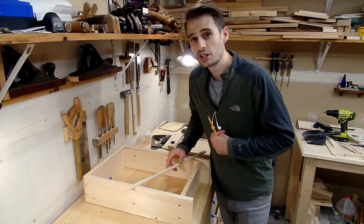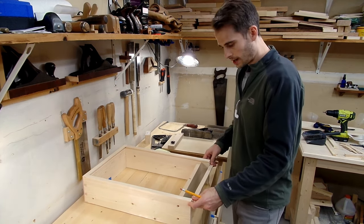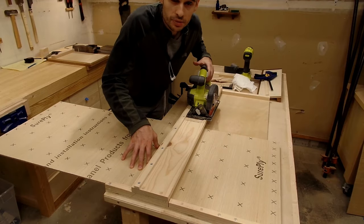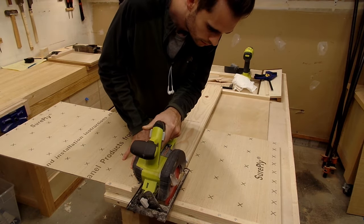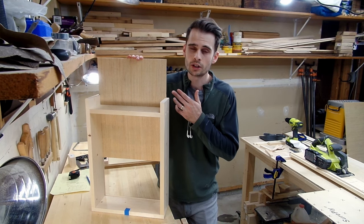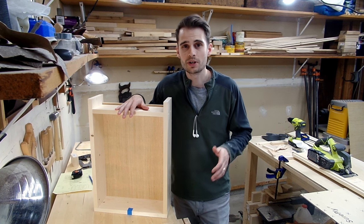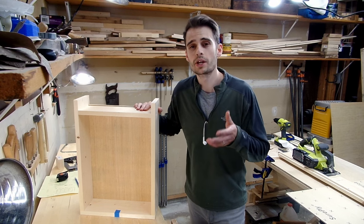Here's a great example of how this jig will help me in my shop. I need to fit drawer bottoms to a drawer I'm making, so I can take a little piece of scrap wood, get the width that I need, transfer that mark onto the drawer bottom, then slide the plywood underneath, line up my mark, and simply make the cut. With a little bit of setup, I was able to make a perfectly 90 degree cut that lets the drawer bottom slide right into place. I have a lot of drawer bottoms to make, and this jig is helping me immensely to make this process easy, smooth, and relatively painless. Thanks for watching, and I hope this jig will be helpful to you in your shop.